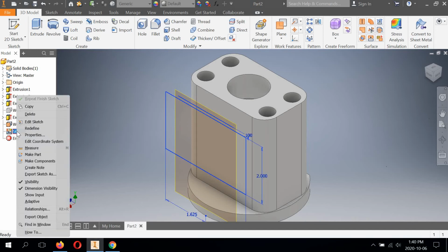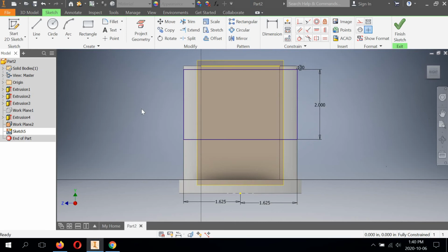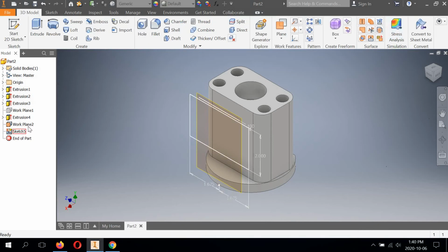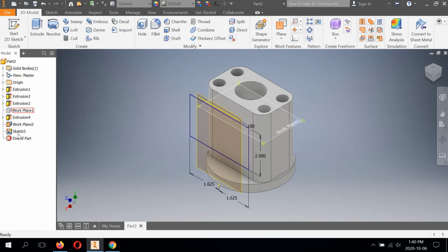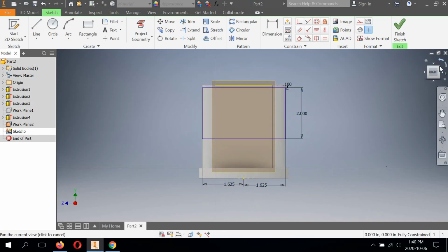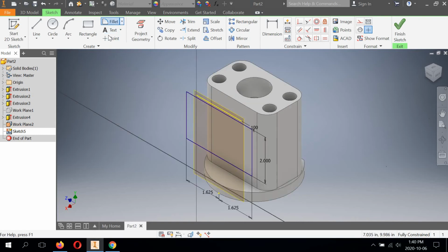go back into Sketch 5 here. I'm going to go back into Edit Sketch. So right click as I exit it out. Just before I continue, remember, if you ever exit a sketch, to get back in, you go to Sketch, right click, left click, Edit, and you're back in. So a little review there from grade 11. We'll hit Fillet. It's already set for 0.5. It's the same fillet value for the body. We'll go around and we'll create these fillets in 2D.